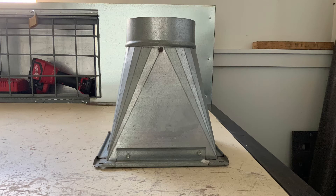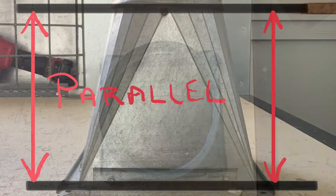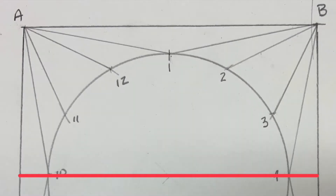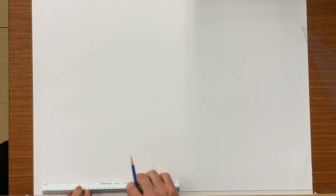Today's layout fitting is going to be the square-to-round. This is the elevation view and the plan view. In order to lay it out the way that I'm going to demonstrate, the top and bottom openings need to be parallel to one another. I could use a quarter plan view or a half plan view, but today I'm going to do the full plan view to make sure beginners understand the whole pattern development. So I'm going to start by drawing a five by five square, because the square-to-round I will be developing the pattern for is five by five square to a four-inch round circle.